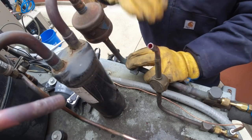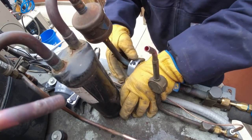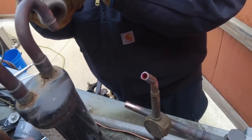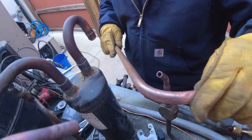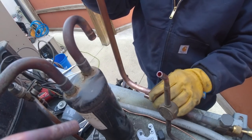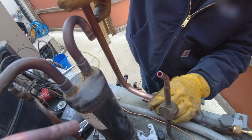Get that pulled up in there — pull her up, capillary up. Looks like I got it. We're going to cut it here so we can swing it in and out — raising it up and down isn't going to be easy with the electricians' wires right in the way. So we got this out of there. All I had was rigid copper, so I went ahead and heated it up with the hand torch, cooled it back down, bent the 90 on there — turned out perfect. Now we're just going to form this up here and then swedge it. The key seems to be just to pull it down and run it through the swager, and it goes fine after that.